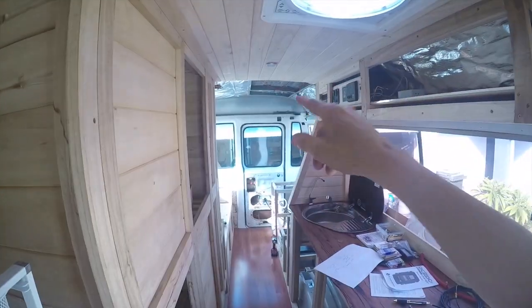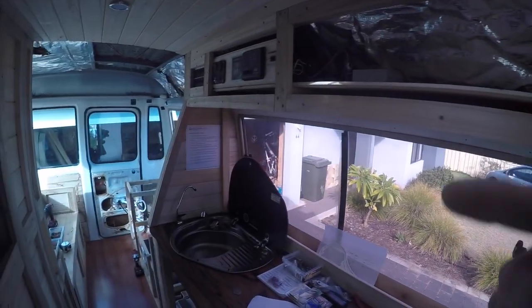She's all fused up, running on a separate fuse because the regs want it to be close to the fridge. Our fuse box down here was a little bit too far away, so we've put a 15 amp on the wall here and run our power up and along.